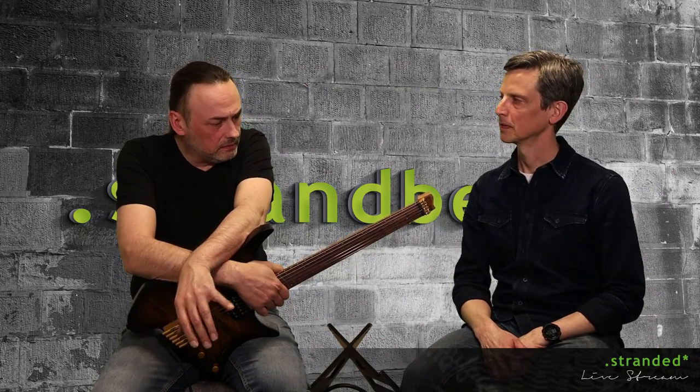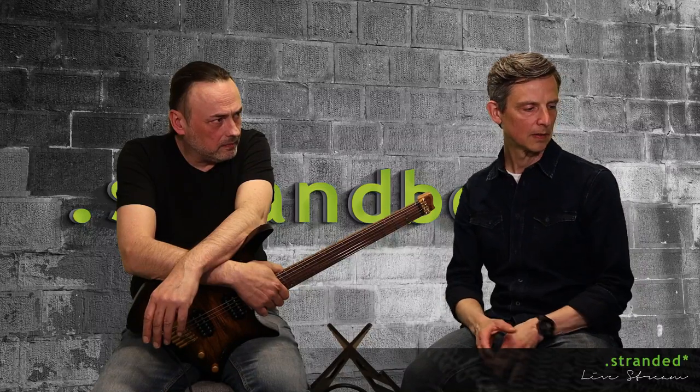So it's another remnant from... No, it's not. It was that company that I contacted back then. You know, using that method of doing castings. And yes, it was really good alloy. Also, the silicon bronze, because it's really hard and durable. It's the same material that you're using for propellers for big ships and stuff.